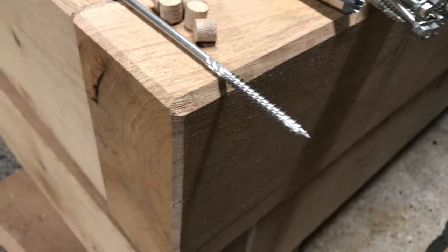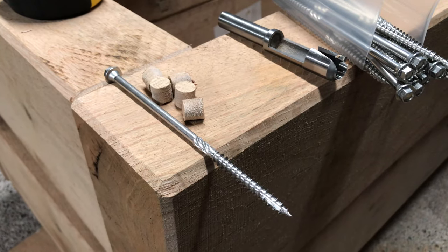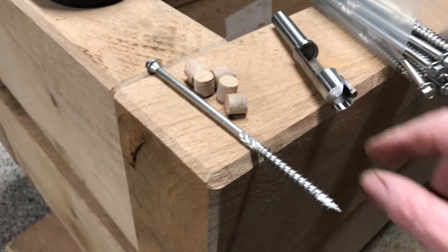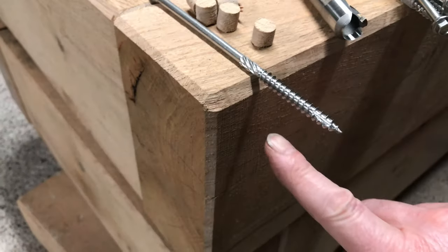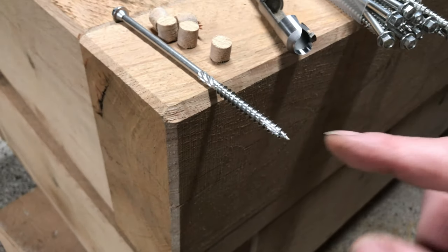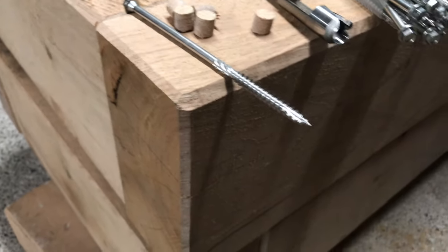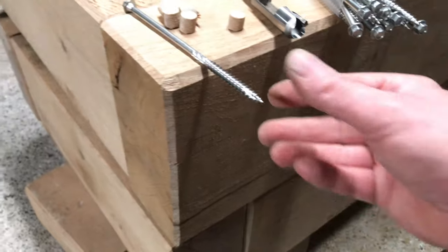I've got some polyurethane wood glue I'm still debating about using, but I'll go with the bolts first and see how strong it is. There's a 12mm plug cutter, and you can see some plugs I've already cut. I drill a 12mm hole, then countersink all the way through with the 5mm bit they recommend for these bolts. Because the head is recessed below the timber surface, you just tap one of these plugs in and sand it off — it won't be invisible but much better than a screw head sticking out.